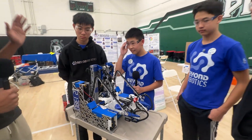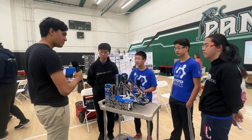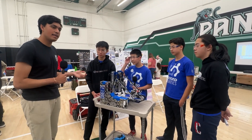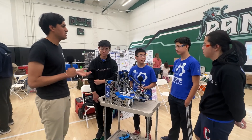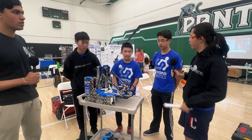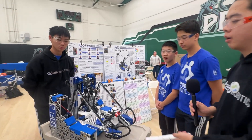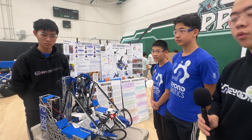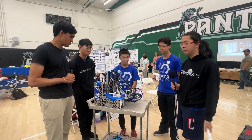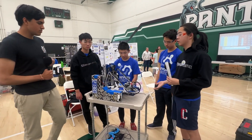That specimen motion is really key for your autonomous period. I see you pick it up on the wall and slam it down onto the specimen bar quickly, turning it in the middle. Did this come through multiple iterations? It came from analyzing the game. We went through multiple design phases across meets - we didn't come up with this transfer system until meet three. Initially we used a single pivot arm, but after testing during meet two we concluded it wasn't fast enough, so we switched to this much better system. Our suggestion: go through testing, don't be afraid to make mistakes, and analyze the game.